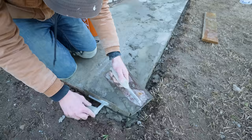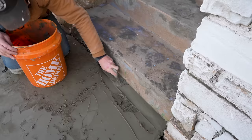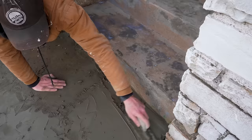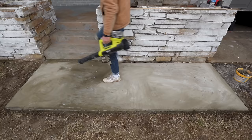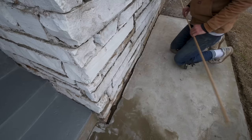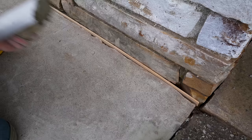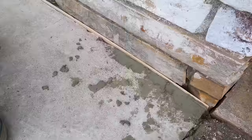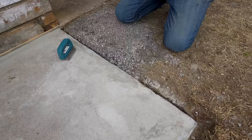As we round out this second coat I wanted to reconnect the porch and the sidewalk like it was originally. This house didn't have gutters for 50 years, but I'm getting them put on, so a lot of the water damage won't happen again — that's why I feel confident doing a recoat. As a final prep step I added an eighth-inch strip of wood between the sidewalk and the planters to act as a retaining wall and give a nice reveal once the sidewalk's done. If you have any expansion gaps, use foam, duct tape, or whatever you can to prevent concrete from spilling down in there.